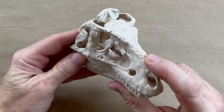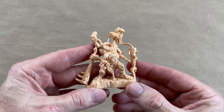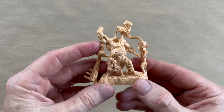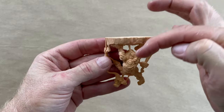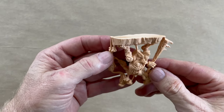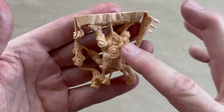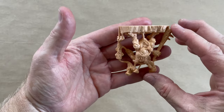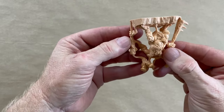That is the only way to take a piece that's this complex and make a casting of it — it's just not possible to do it any other way. This piece was designed by the manufacturer as a kit, but I took all the parts and set it up for resin casting. So it casts like this: pour the resin, flow down to the bottom and rise up, and everything's in perfect position to cast and fill perfectly. That's another example of why it's advantageous to think about the piece while you're designing it for casting. By doing that, you have a chance to have a piece that can be cast in a single pour. The take-home lesson is: make a kit. If you start with an idea of making parts, you have a chance of making a piece that you can actually cast successfully in resin.